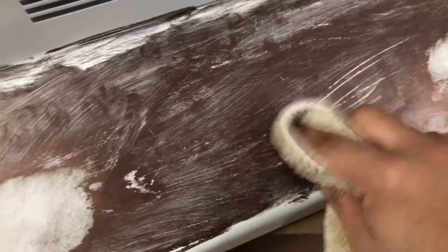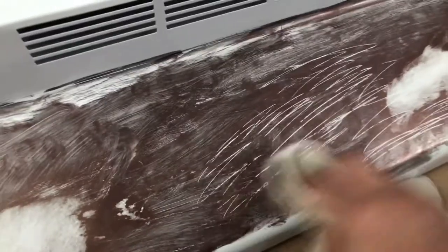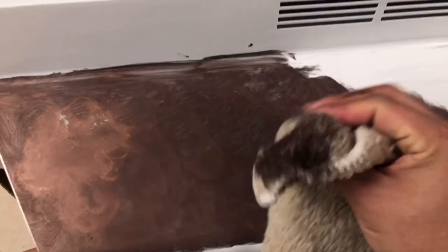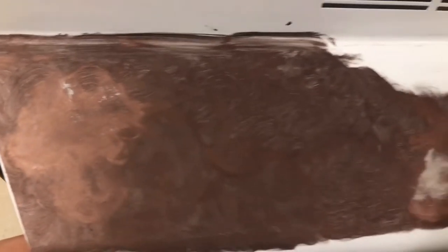So at this point I just grabbed the clean side and started to remove it. I wanted to see if it was easy to remove, and yeah, it was completely easy to remove, so I just started to remove everything. Then I was like, you know what, let me give it one last shot — I used my fingers and some part of the cloth. From far away it looked okay, but up close it was uneven, had bald spots, and was lumpy. It was a hot mess, so I just decided to sand it down with 100 grit sandpaper to remove the product because at this point I was just done with it.